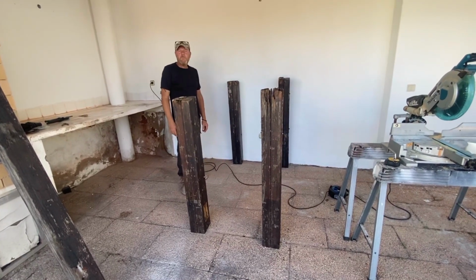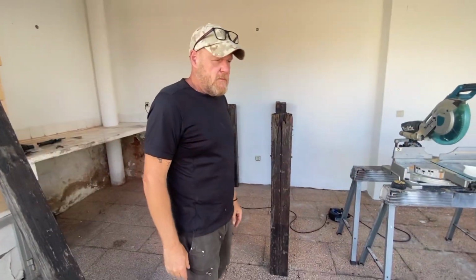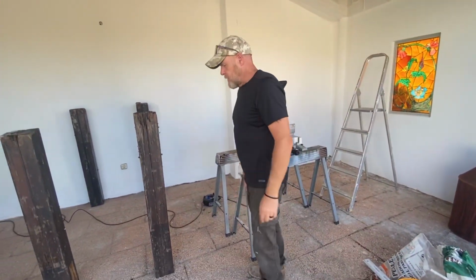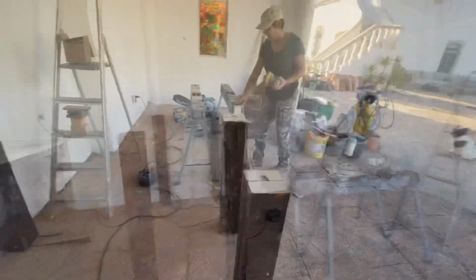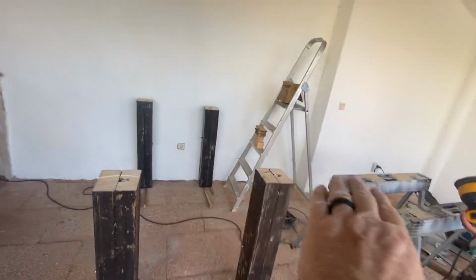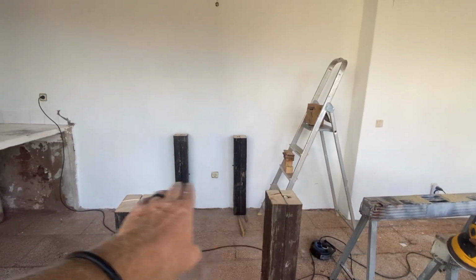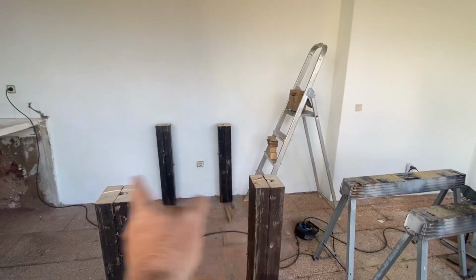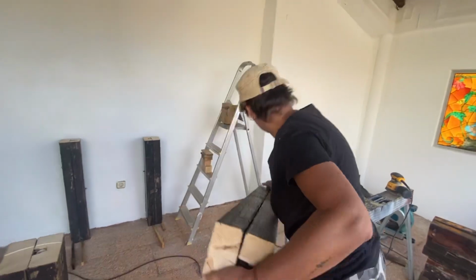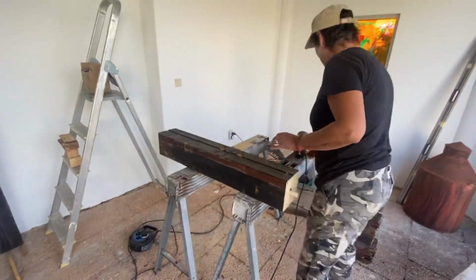What we did: marked a 92. There's your pencil. That's your tape measure. What I need is a spirit level. What we've done is we've used the laser level. We put these in place, got them level on the floor, and then put a laser across the top to get the cutting point here. Christina's now going to sand them down, and then we'll do a little bit more cutting. We're basically building like a table, I guess, is the concept of what we're doing.